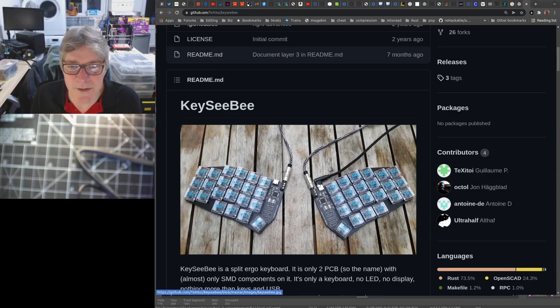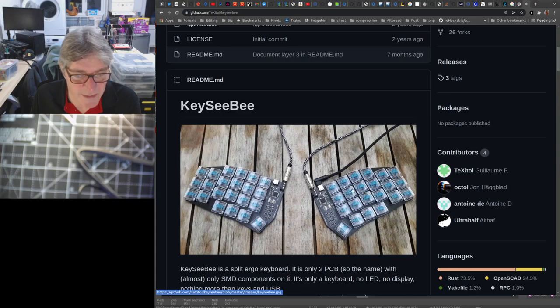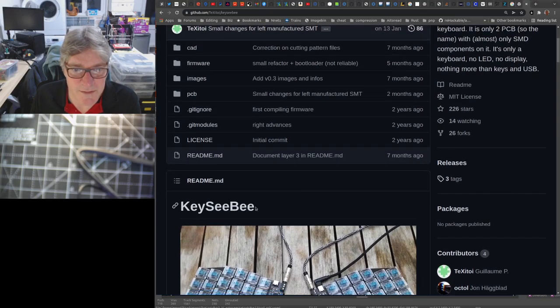But what you can do is operate it in a UART mode. The keys on this side are sent over the UART to this, and there's an event system, so it can take those keys in as well as its own keys. So the mode I was thinking of operating in is running the main code on the STM32, and having these two as two jacks, UARTs as slaves, and this is just one keyboard.